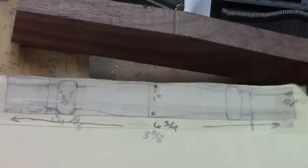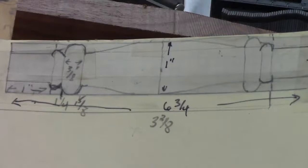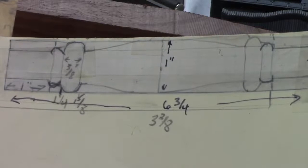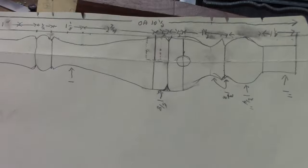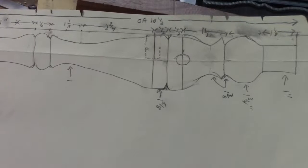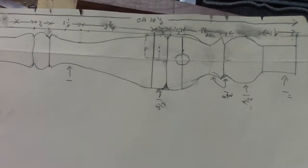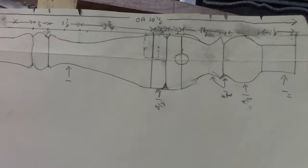Okay, here's a close-up, I promised you. Here's a storyboard, one of the early ones I did, that's showing the incorrect way to put the inside dimensions, where it's on the inside of the drawing and tends to clutter it up and be confusing. Here's the new revised one I did for this stool project. So along the top, you've got an overall length, one line with the distance in the middle. And then for each feature, you've got the length of that feature, all of them connecting one to another, separated by arrows, with the measurements actually in a broken area between the lines.